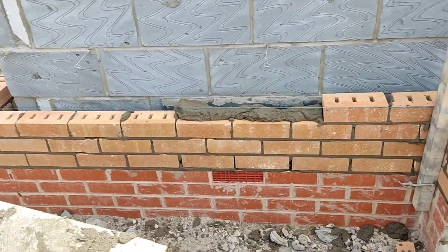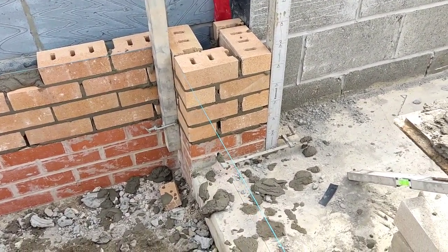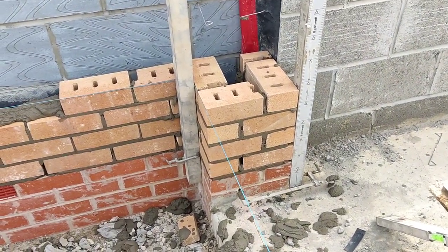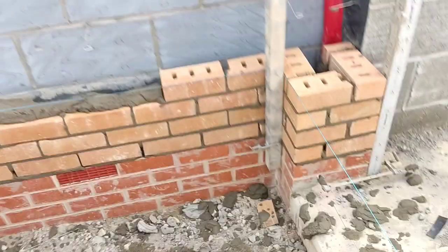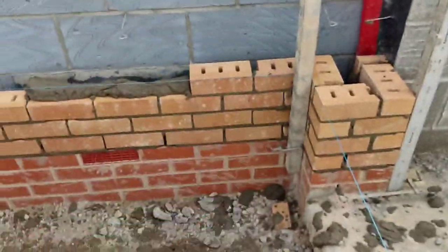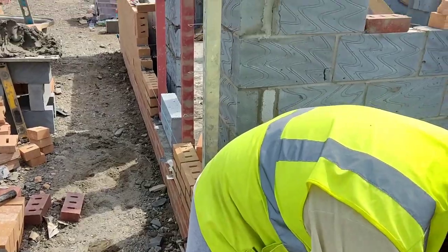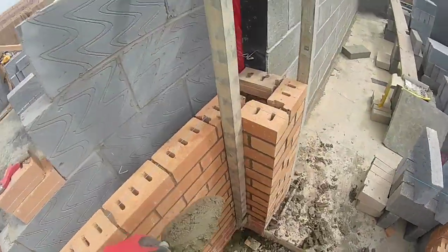So on this little fiddly pillar with three quarters, they said originally that we could change it to brick, but I couldn't be bothered, so we've cut all the three quarters, three per course. Got a three quarter on the internal anyway, seems always there's a three quarter on that internal, and then down that front there. Yeah, I'll get some head camera, I'll see you in the next one.